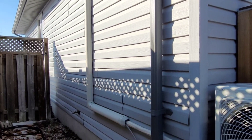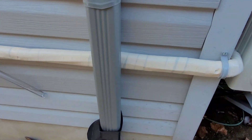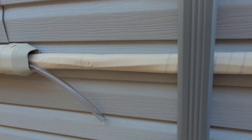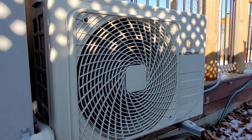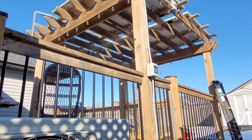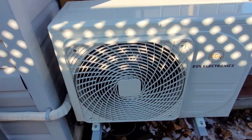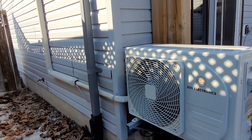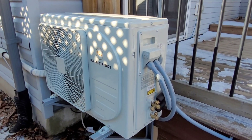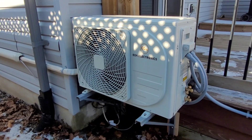Everything's in its final form now. I've got to cut that piece of drain off once it's a little warmer out — I want to bend it down first. I did wrap the line set in this white protective tape they included. I don't really love it; it looks a little cheap. I figured I'd try to protect the installation as much as I can. Those are my solar panels — I have a little disconnect and breaker there. This is a one-ton solar heat pump, meaning it can run directly on solar panels when the sun is out. I have six Canadian Solar 230-watt panels at 35 volts each, so in total I have 210 volts DC of solar and just short of 1,400 watts.